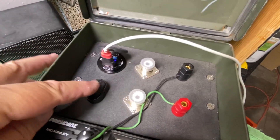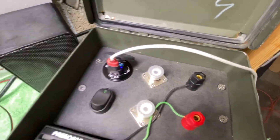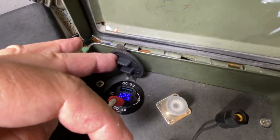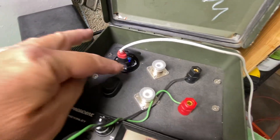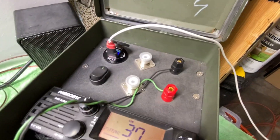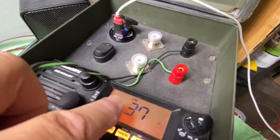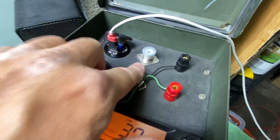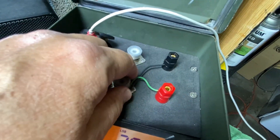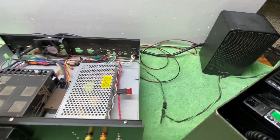Basically what I have here is a master power on/off switch. That LED light burns out about five hours into the whole thing. Over here I've got an eBay/Amazon voltage meter with a USB charger, which I'm actually using right now to power the phone. We also have SO239 connectors — this one's for the lower radio, this one's for the upper radio. I should label those one day. And then we have power posts here — this is 12 volts in and out.